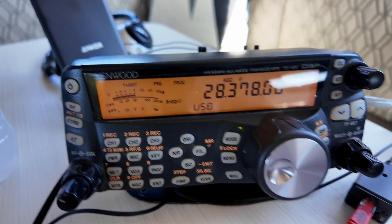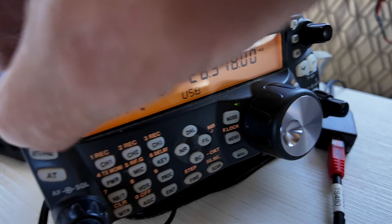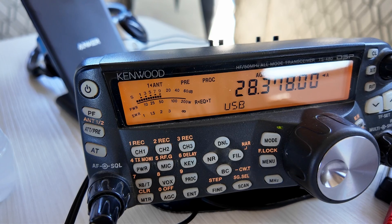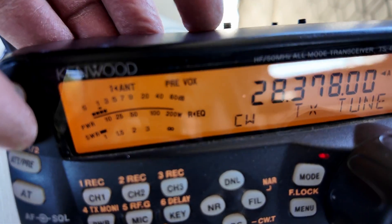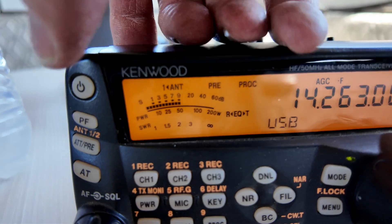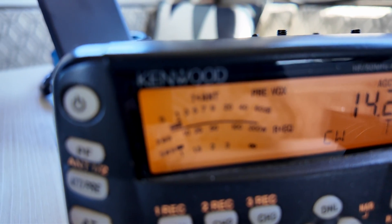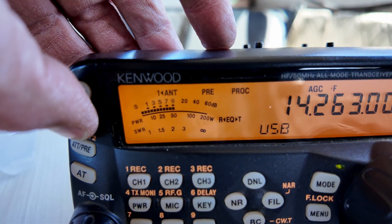It's way out of tune, so I press the tune button and send my carrier — and now we're good. When I check my SWR, it's 1-to-1. I've noticed on a bunch of frequencies: when I hit the tune button on the remote tuner head and throw my carrier, I count to five as the manual says it could take up to five seconds. At about three to four seconds there'll be a blip in my SWR reading, and that's usually an indication that we're good to go.